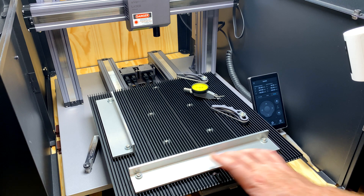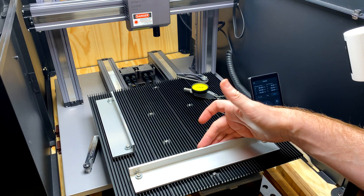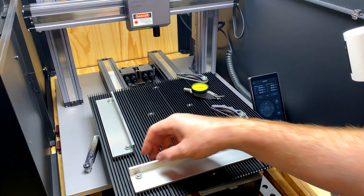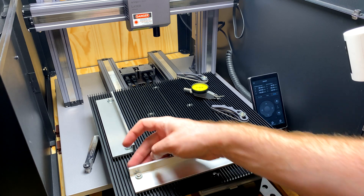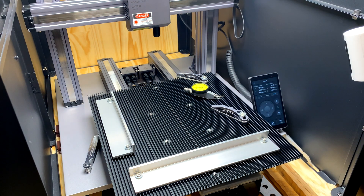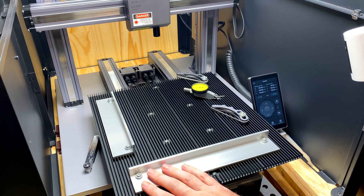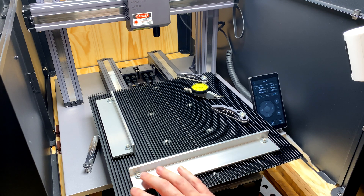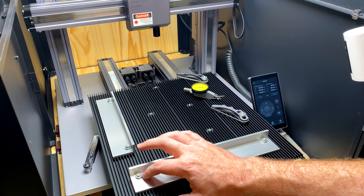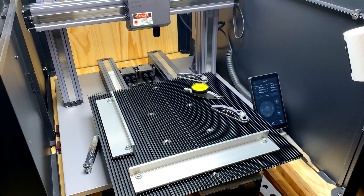You can do the same on this side too - just slightly touching, then run the laser head across the fence with the bolts not tight, because you don't want it binding up. You just want it to nudge the fence a little bit to help line it up and keep it running true with the machine. Even if you drilled the holes dead accurate, you'd still have to tram it in when you put it on the bed because the holes on the bed might not be parallel.